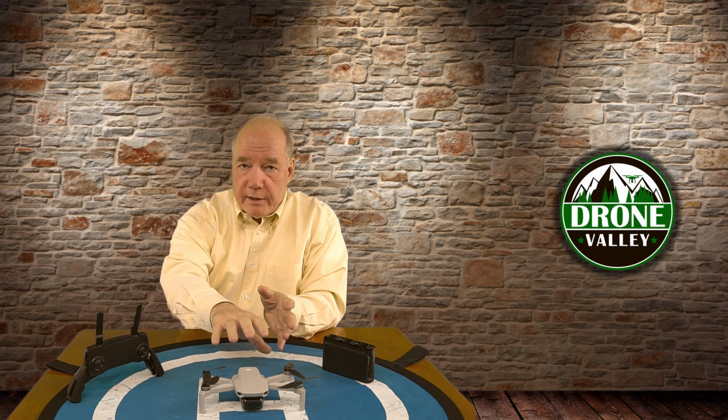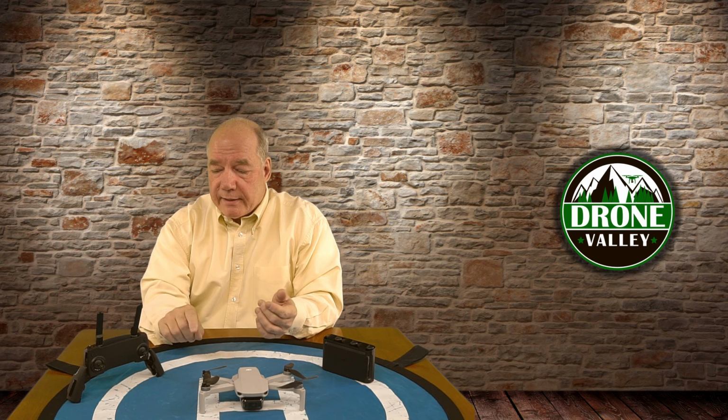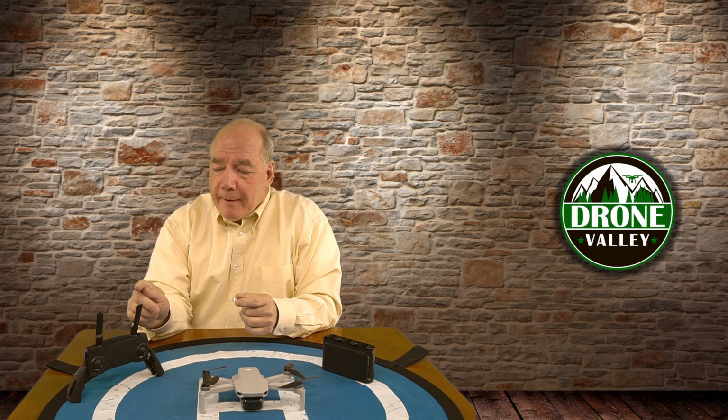All right, what else did I want to talk about? Oh, the controller. One of the most sensitive parts of this entire enterprise is the transmitter inside the controller, because you've got a Wi-Fi transmitter. You've got one in the drone as well, but for some reason when it's flying, it gets warm. The controller's doesn't get as warm and it tends to get neglected. You're focusing on the drone, keeping that dry and keeping it warm. You forget that the controller's got a transmitter in it. If this transmitter gets cold, you're going to start seeing problems.